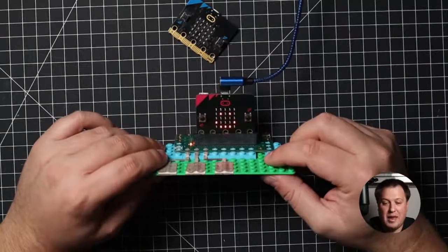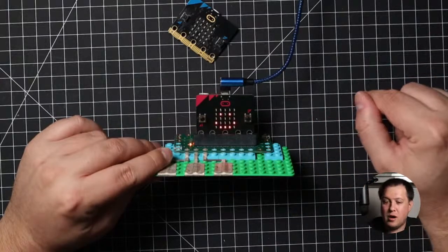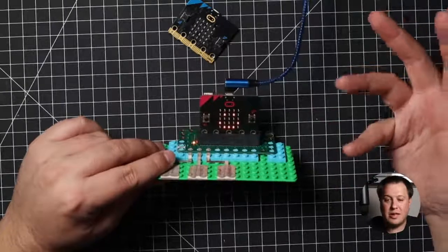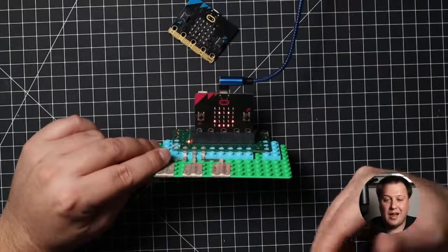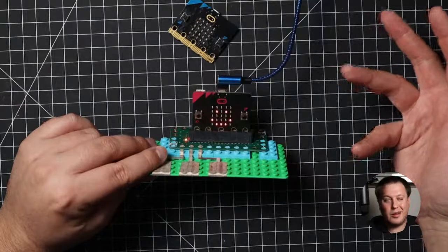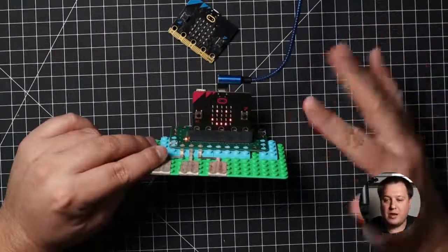And actually, that's what people did with regular Arduinos to get very simple capacitive touch, before people had it built into some of the Arduino clones, like the Teensyduino. We use the Teensy LC a lot. It's a great little board, pretty inexpensive, with a lot of capacitive touch points built in. But if you have just an Arduino Uno and really want one capacitive touch point, you could do something very similar with just a little bit of work.